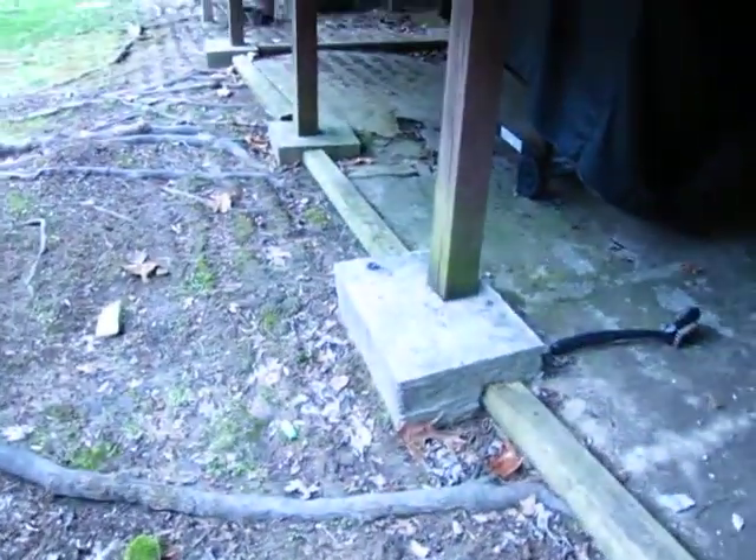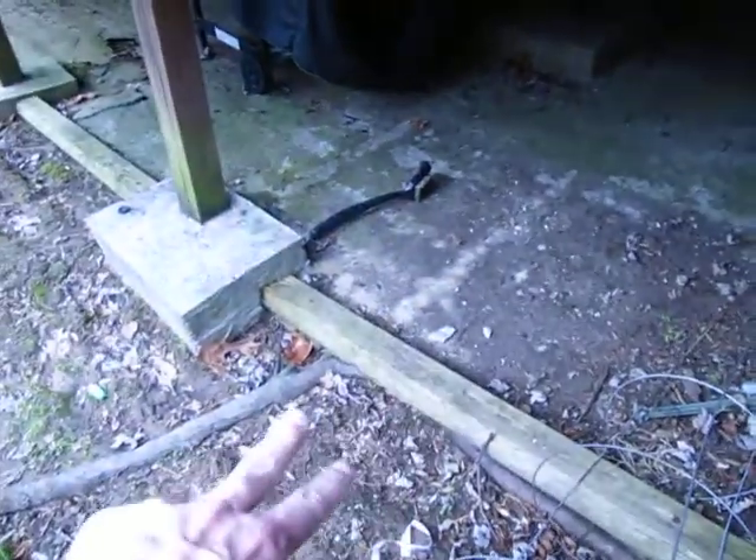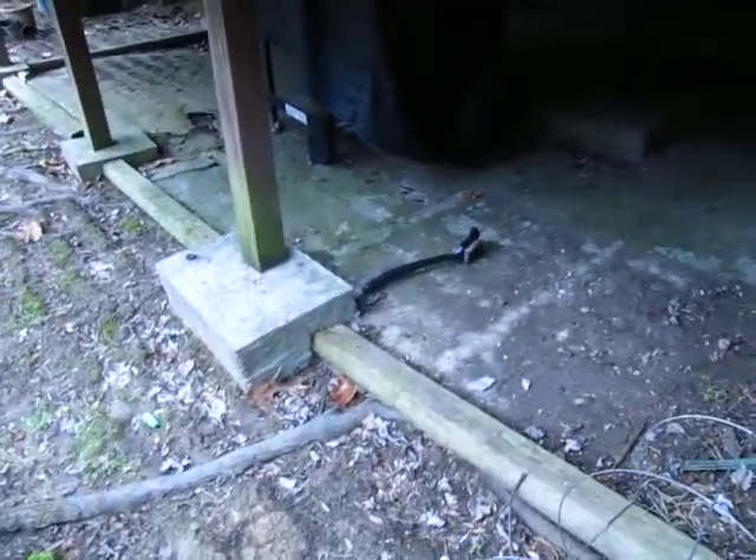They've got some amazingly wonderful footings here. It shows no sign of moving concrete, which actually works against you because you need to have a gap cut so the water can freely pass. Structurally, you are not on code because those joists are 24 or 36 inches wide. The code is 16 inches on center — we all know that.